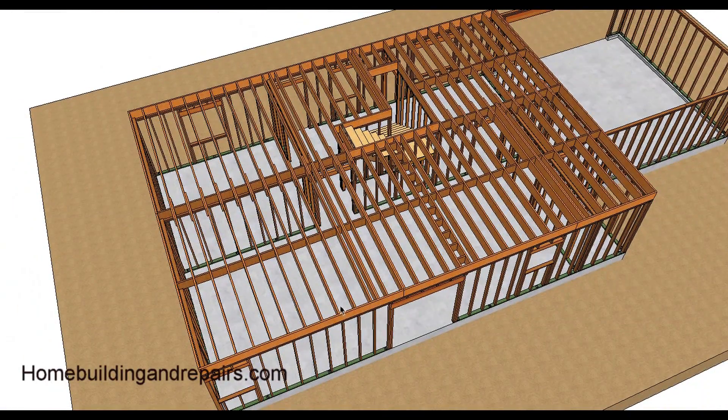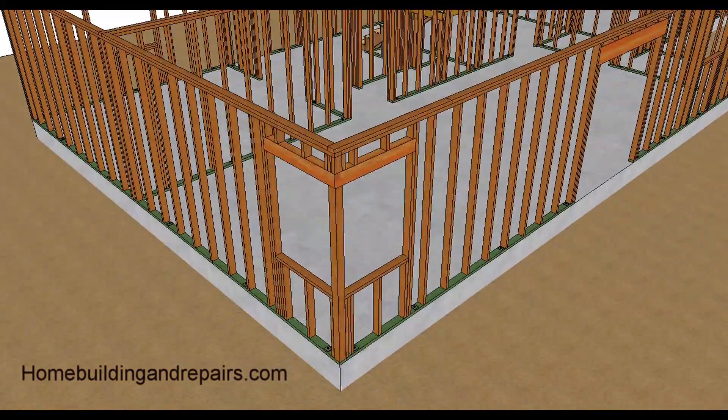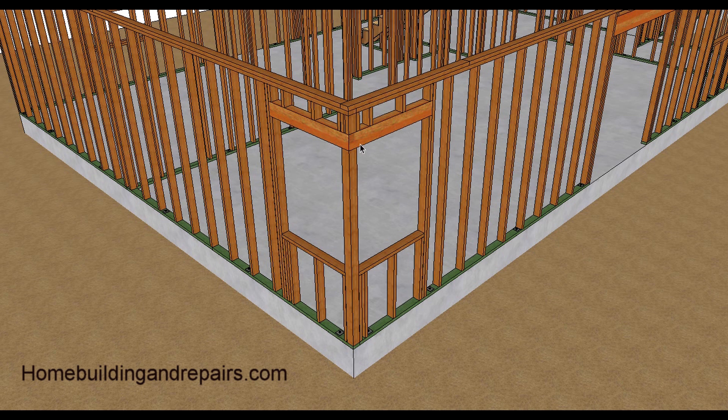You can go back and look at the walls — here's a doubler here and a doubler here, which would be the closet area in one of the bedrooms. Let's remove the floor and take a look at the wall framing: living room, den, entrance to the house, dining room, kitchen area, garage, half bath, and the washer and dryer area. Zooming in on this corner, we have headers that have been mitered at a 45-degree angle. They connect together so they can sit on the post to make a nice connection and transfer the load down.